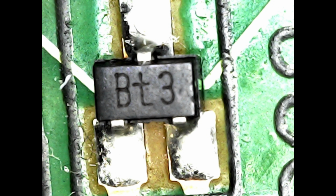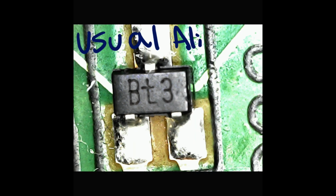Not expecting much due to the burn, to my surprise, there were two conductive coupling pins. One is connecting from number 3 to number 1 and the other from number 3 to number 2. I found information about the transistor as it is packaged in SOT-23 online, where the standard configuration usually designates number 1 as the base, number 2 as the emitter, and number 3 as the collector.